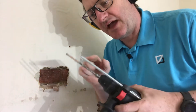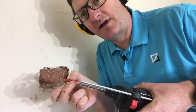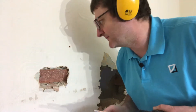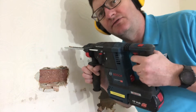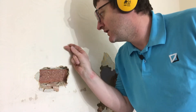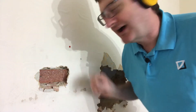I've got a depth gauge on my drill, so I've set it so it's just a little bit deeper than the actual length of the wall plug. You saw me go in and out a little bit — that's to pull out the debris, the brick dust, because if you leave it in there you won't get your roll plug in. Then simply push your roll plug in.